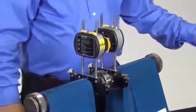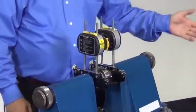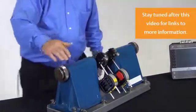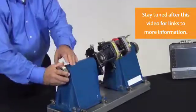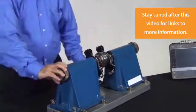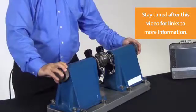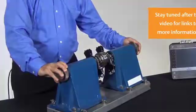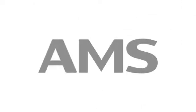So you've already seen how to use the sweep mode. We simply initialize the heads starting from whatever position you want, rotate from the drive shaft as far as we can go, retrieve the data, and at that point we'd be able to have a precision alignment on this machine.